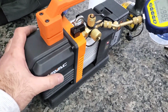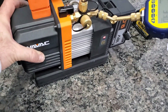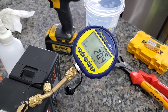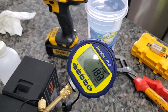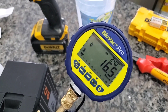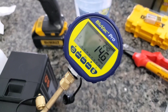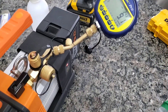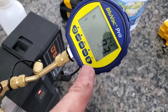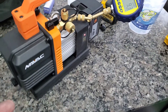The pump has a slow ramp, which is great — I enjoy that. You can hear it slowly ramp up. Look at that, we've already hit 20 microns in a matter of seconds. So we're down to 15; let's see how low we can get. After running for about three, four minutes, we're right around nine microns — that's about six below what the nameplate says. This pump is doing quite well.